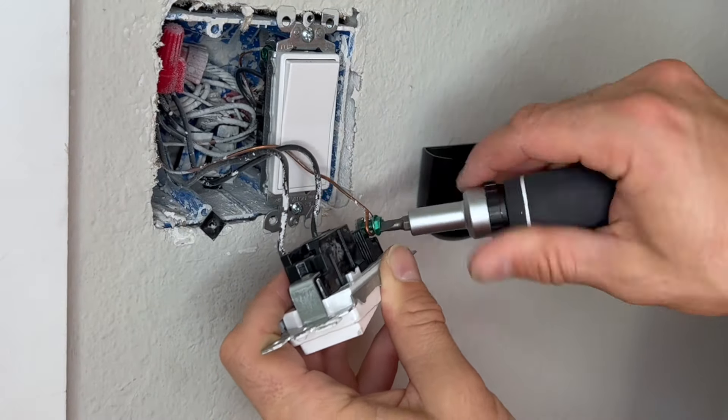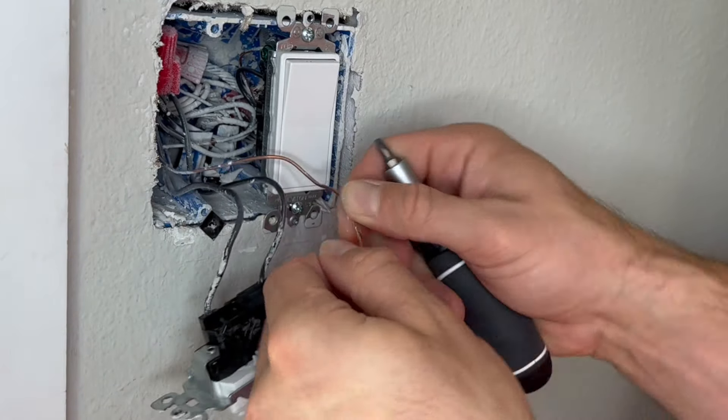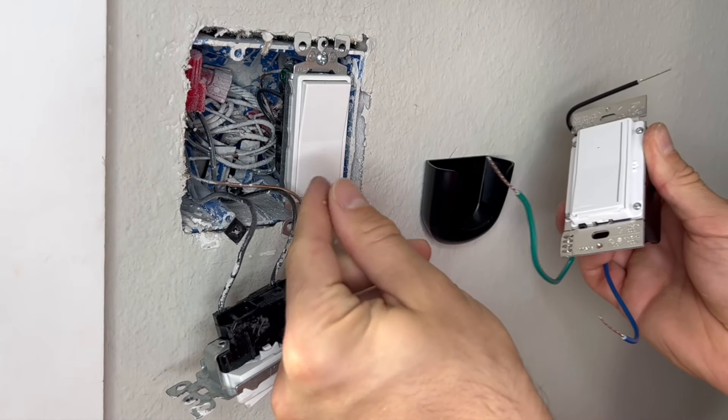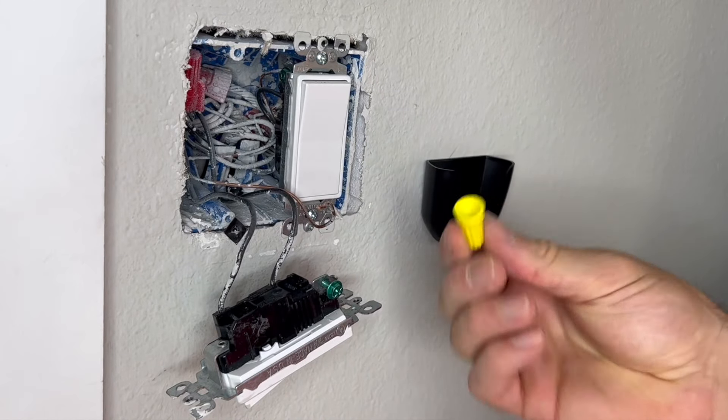As well as an exposed copper wire which is the ground. First we're going to remove that ground wire. If you don't see an exposed wire like this it may be a green one — anything that's green has to do with ground. For example, the ground wire from the new switch is also green, and we're going to connect that to the ground wire coming from the wall. This is where you'll need those wire connectors.